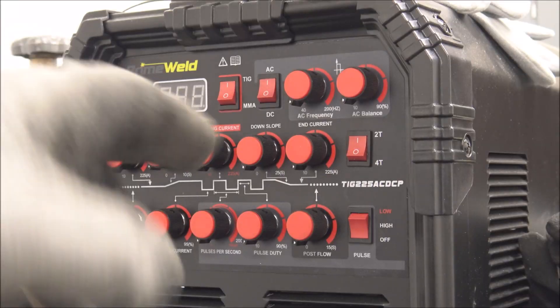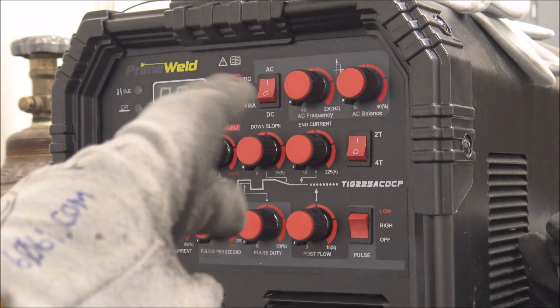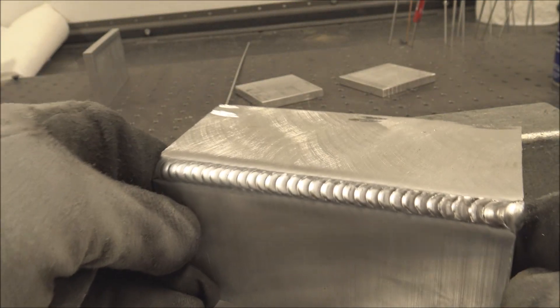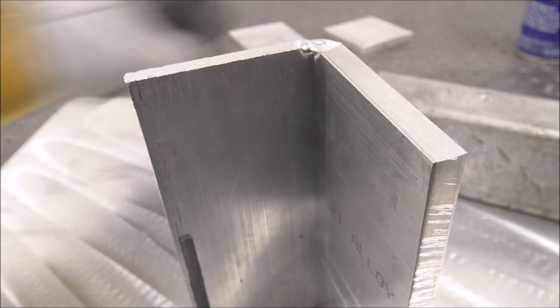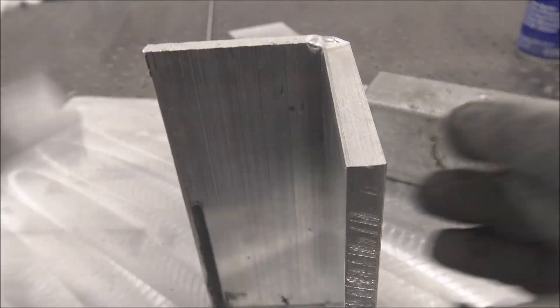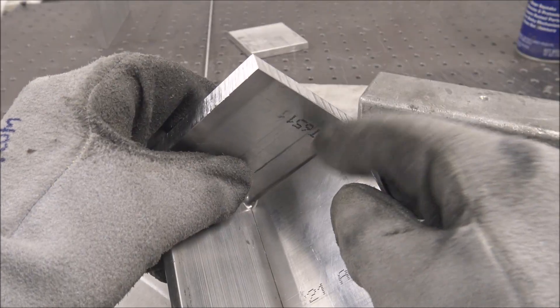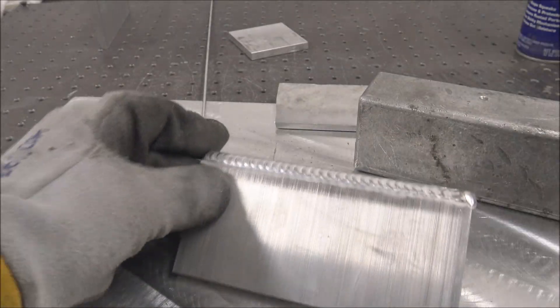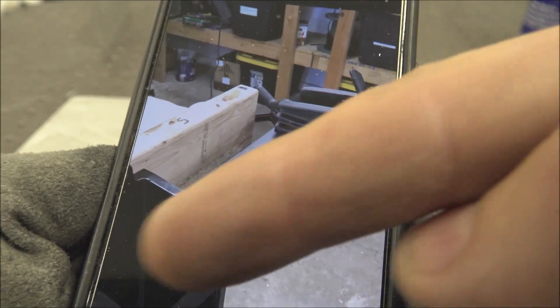I asked him to email me a screenshot of his exact welder settings on this machine, and two of the adjustments were off from what I would normally use. If you want to learn how to go from this to this, I'll show you exactly how I do it on my website. On the parts he was making, he had like a top cap, triangle piece, and I would wrap around and weld a little bit of the backside too right here for a little more reinforcement - like a half inch or so. Because that's where it's going to be prone to break with all the flexing. He's making a mount for his trolling motor - this angle piece here that bolts to the ends.